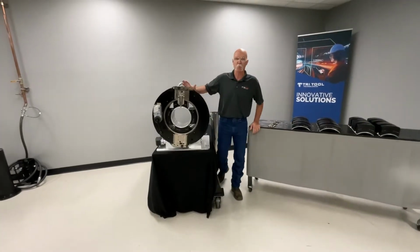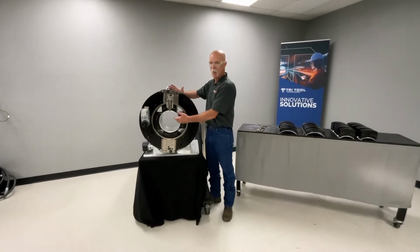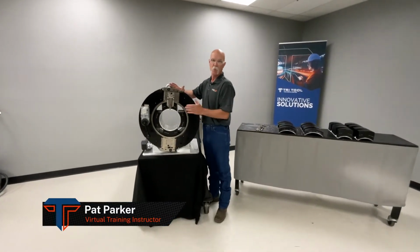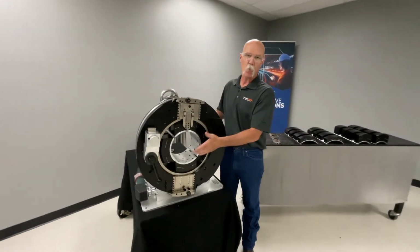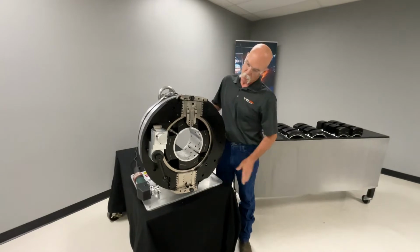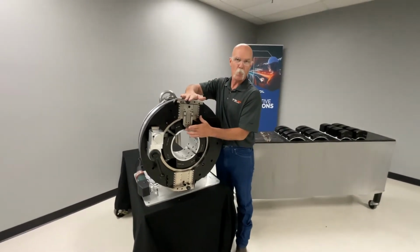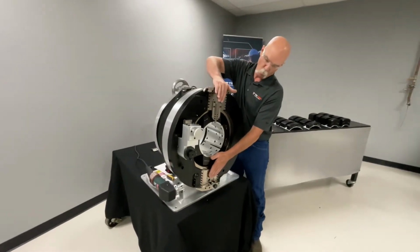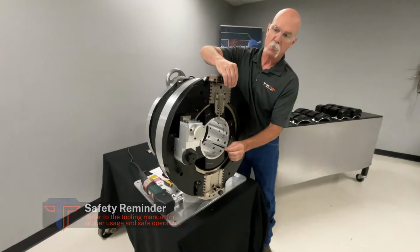All right, today here at Tri-Tool Technologies, we're back with the 5712. This is a pipe and tube severing machine. It can range from 7-inch to 12-inch and go up to 1/4-inch wall. It's got capabilities with a single tool holder when you're running on your thin wall pipe, or a double tool holder so you can have a lead and a trail tool bit for that heavier material.